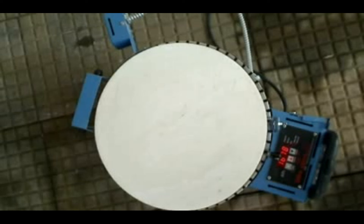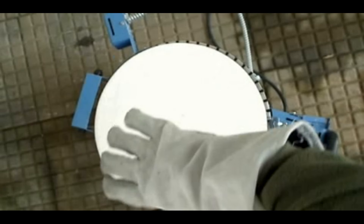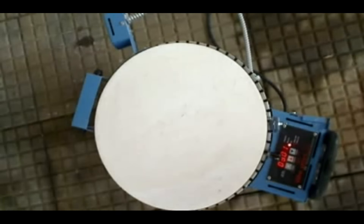The kiln is holding at 1680 degrees. We've got that 3-hour hold on there, so if we don't get to the kiln right away or forget about it, the temperature won't continue to drop. My hands are covered with good gloves that won't catch fire when I open that kiln, and my arms are also covered. This blue box on the back of the kiln is the switch that triggers the power — when that lid is lifted, the power is cut to the inside of the kiln. That's really important with this process because when you're reaching in with metal tongs, if you were to come into contact with the elements, you might get zapped. It's an option to add on to the kiln, but I strongly suggest spending that little bit of extra money to make sure you're safe.